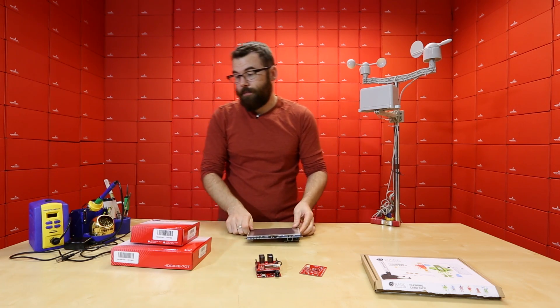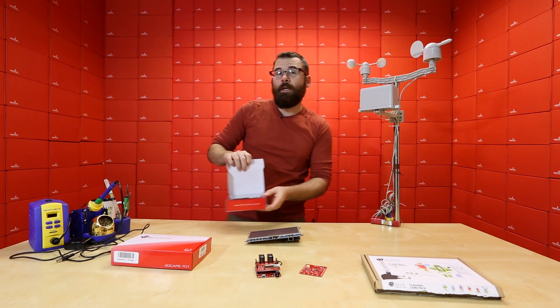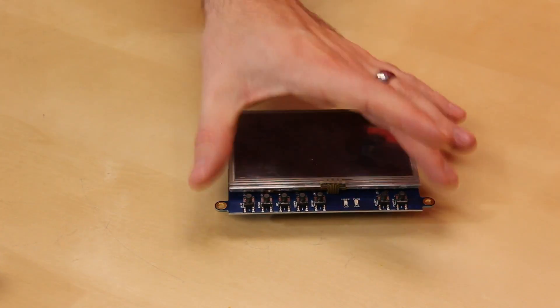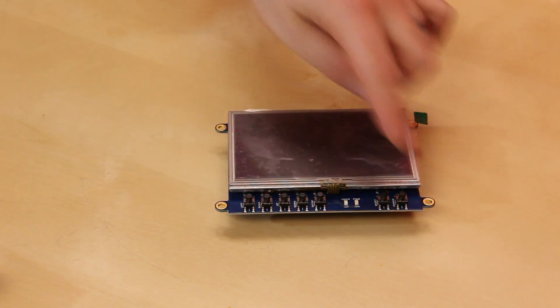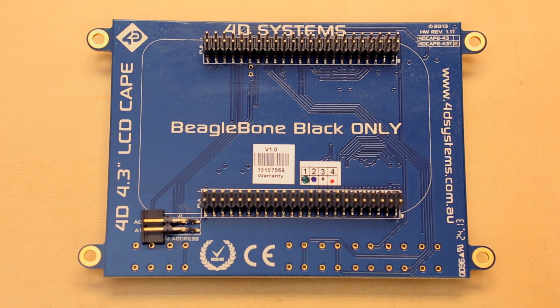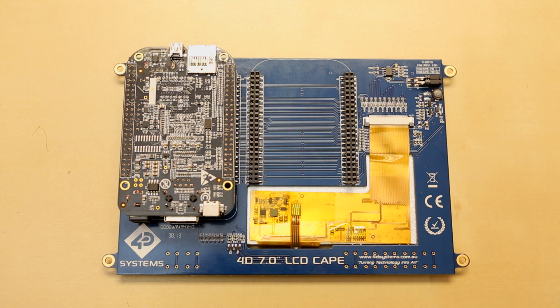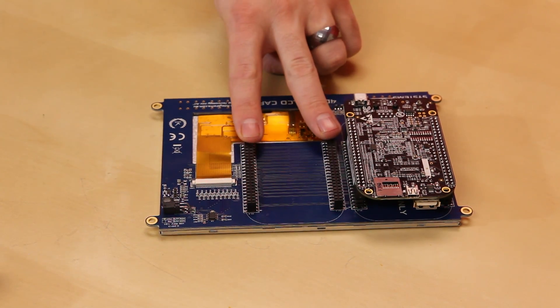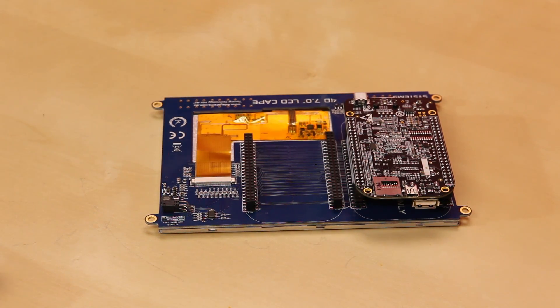These are big LCD capes and they have two different sizes: a 4.3-inch and a large 7-inch. The 4.3-inch has nice mounting tabs on the side, up/down/left/right select buttons, a couple of other buttons, and status LEDs. The 4.3-inch shield has two rows of headers on the back that connect directly to the BeagleBone Black, while the larger one has two full sets of headers so you can plug in the BeagleBone Black on one side and plug in another cape on the other side — effectively daisy-chaining or stacking your capes.